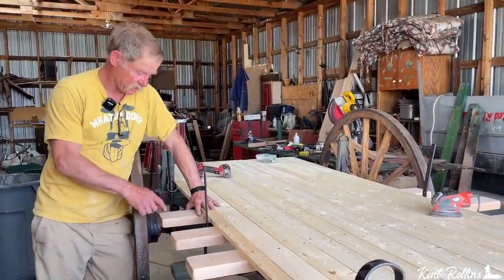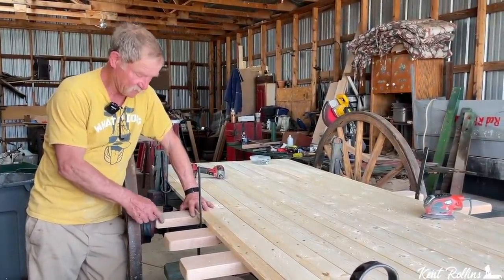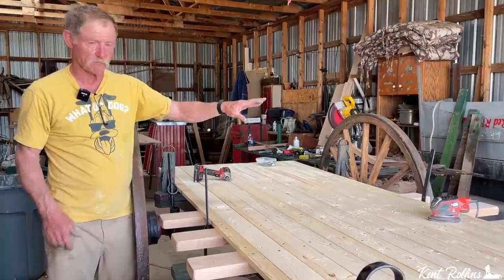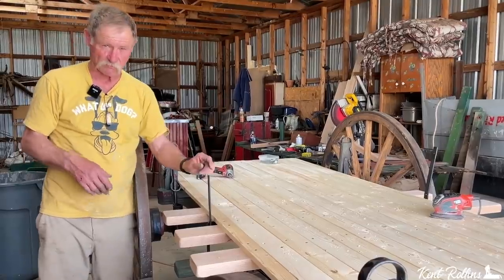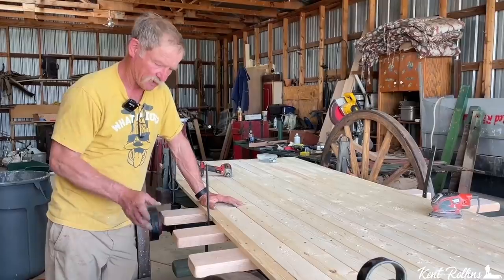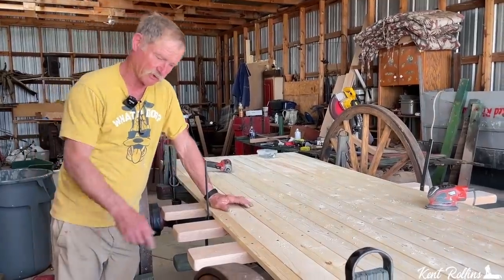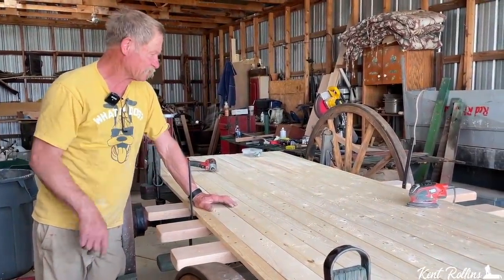The boards that were under here were actually just 2x4, which is 3.5 by 1.5 inches. These are a full 1.625 by 4 inches solid oak. So I know they're gonna give it a whole lot more support because that water barrel is really what started this deal to sagging many years ago, because that's a lot of weight when you get 30 gallons of water in it. So we had to mill them down, run them back through the planer to get them the thickness we wanted put on there. But then again, when you go to screwing through there, if you don't have a fine thread screw, you have to drill every hole or you're gonna twist the head off them screws. So there's a lot of stuff went back in it.